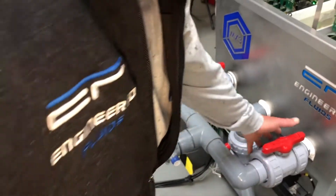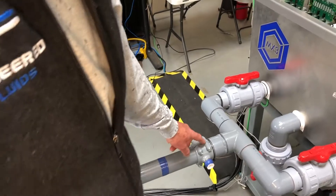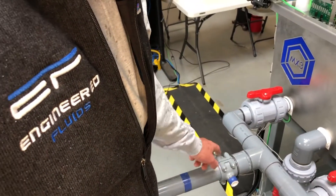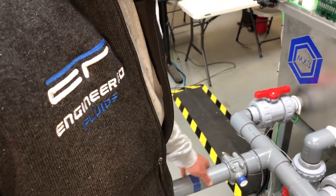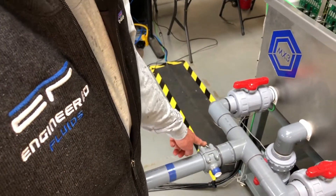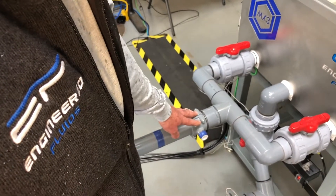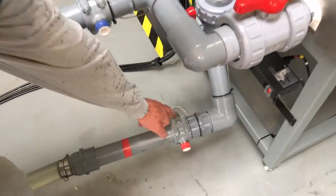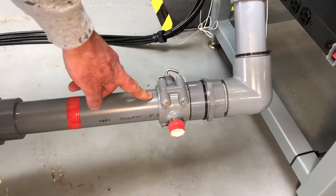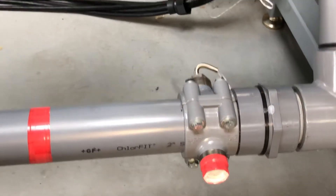You can see that we've got the valving and all these different fittings. These are another great feature — you can add them to any length of pipe, and we use them particularly to add in all of our temperature gauges and all of our temperature sensors. You can see how easily they operate. We can put one on each side and they can go anywhere on this pipe — you just drill a hole on each side. It's really efficient.